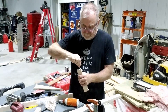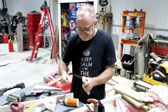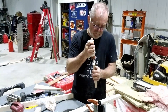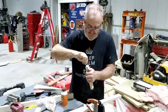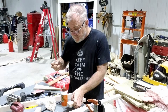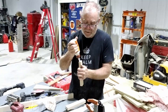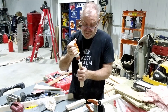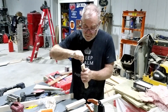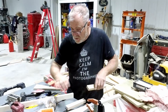Then I'll take the nylon strap and just work it in there so that I know it's near the bottom. Same on the other end. Once those pegs — because they're compressed, those little dowels — they are compressed, and the idea with them and the biscuits is that they swell and fill the gap. The addition of moisture from the glue does that, and the glue does its own thing. So you have two components working to create good adhesion for the joint.